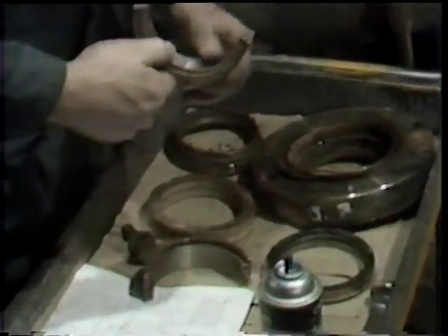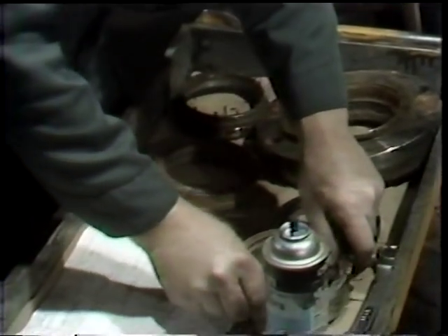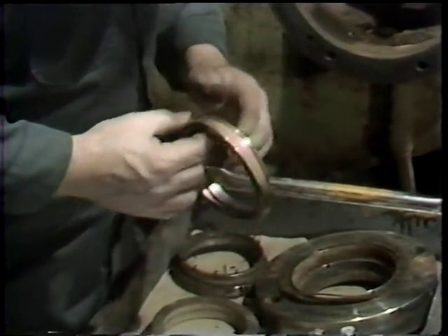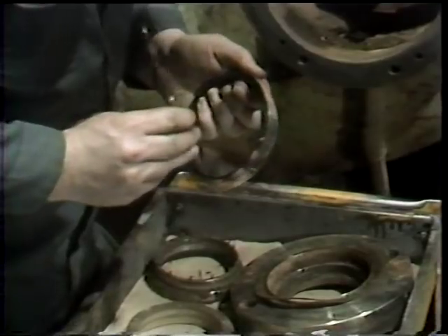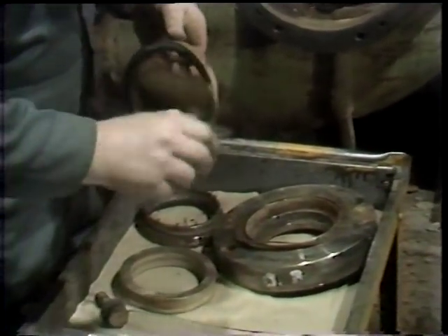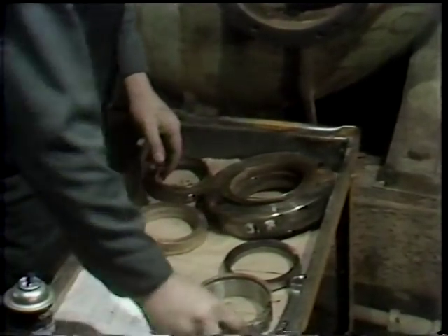The function of the two-piece locking ring is simply to clamp around the shaft and hold the rotating seal face in position, so it's unlikely that these parts would be worn. However, the seal ring itself requires a very critical examination because this is a part that will wear over a period of time. In the case of this seal, even though excessive leak off had been noted, no evidence of wear or erosion was found on the seal face. However, the workman removes the o-ring which was used to seal between the rotating face and the shaft and found it badly worn. So apparently the cause of the excessive leak off was not a failure of the seal itself but a failure of that o-ring.